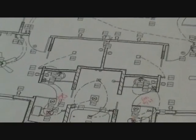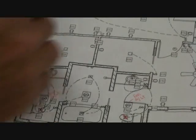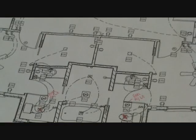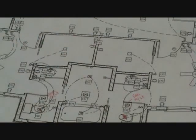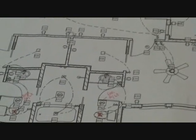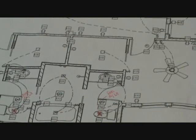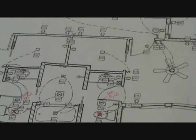If I go over to these plans and count them up, there's one E05 here, here's another E05. I'll find the others and take a felt tip pen — yellow or pink — and highlight those, then match them up to make sure I understand where everything is. That way when I order materials I get the right amounts, and I don't miss one in a closet or behind a door.